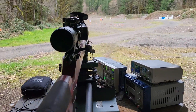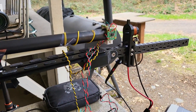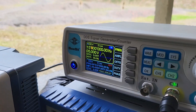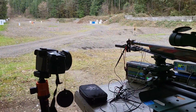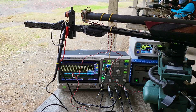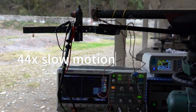Unfortunately there's something wrong with the gyro sensor's wires and it's not working. However, we have the vertical accelerometer and the lateral accelerometers are working. This is my setup — we have a function generator feeding the proximity coil, and my slow-motion camera doing the barrel whiplash capture. There's a little bit of latency from the scope trigger, but it should trigger as soon as it detects the bullet going through the coil. There it goes.